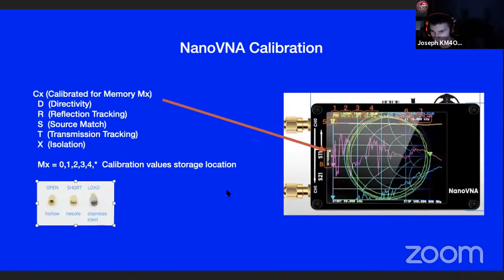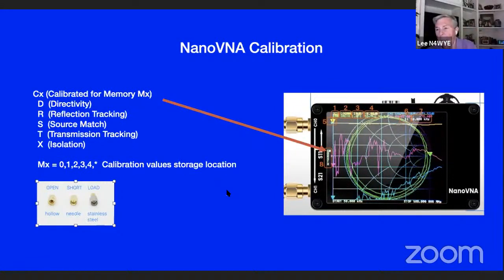But basically what happens is if you keep spinning the calibration pins on the connector that's in the VNA, you're going to take off the gold, because there's not much gold on there. If you put the calibration thing on there and spin it, it's a metal pin spinning in the female connector. So if you put these things on, the gold wears out, you replace the $2 part. So that's why I put these on here, and it's really a useful thing. But I'm getting to your point now.